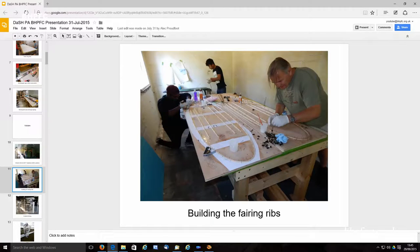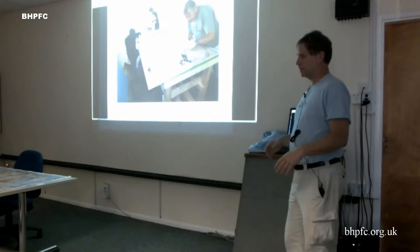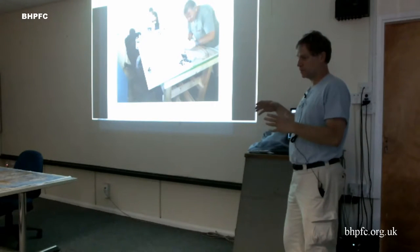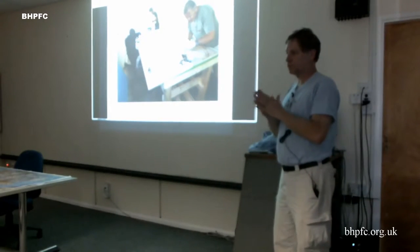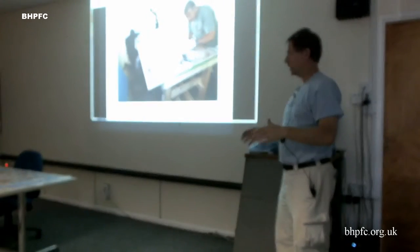So we took one of the ribs from the Dash fuselage, which I'll show in a little while, which was the right size. Because of the upright pilot position, we couldn't make a tapered fuselage like Airglow and Aerocycle and Betterfly and everybody have. We had to make a 2D fuselage that was just the same rib over and over so that the pilot would fit in between.